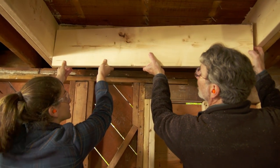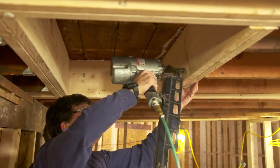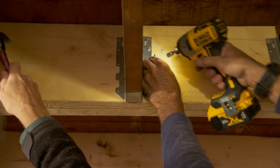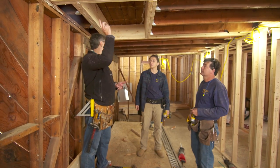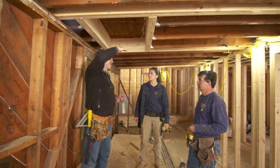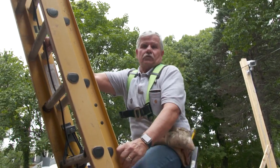Alright, so now we can double up this one. Now the last thing to do is put the hangers on this side. Alright, Carly, now here we have the opening for the new skylight. If it wasn't going to rain today, we'd cut open the roof. It's going to pour, so we'll leave that. When we do cut it out, we'll put up a curb, which will raise the skylight above the roof, and the roofers will flash it. Norm and Charlie framed for the skylights, but it was raining too hard, so they couldn't put it in. So this week, we're going to finish it up.